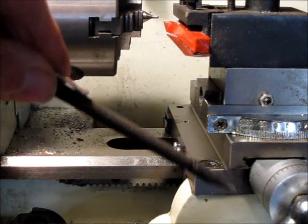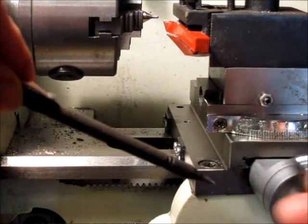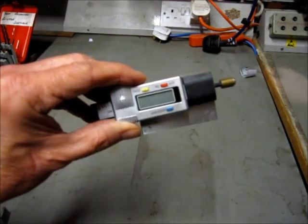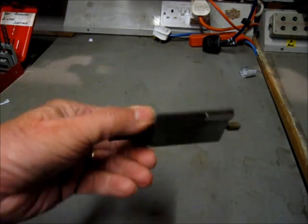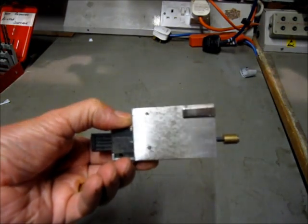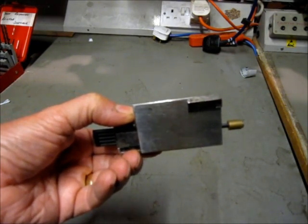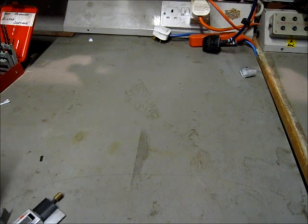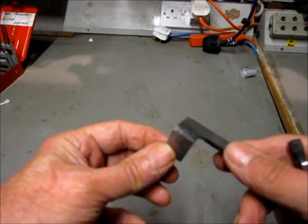What I'm trying to do is make a mounting which will position it here so that the DRO part sticks out of the front of the lathe but clears the wheels and so on. What I've done with the DRO is stick it with epoxy resin onto this small steel plate. On the back of the plate I've stuck a very small but extremely powerful neodymium bar magnet, so that it mounts on the static part of the cross slide.